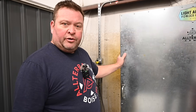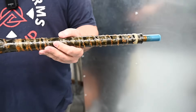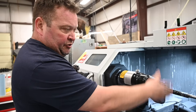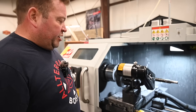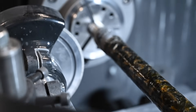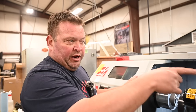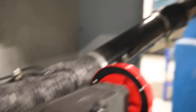Now we'll show you the finish grinding process. We have a barrel set up in the lathe with a custom grinding motor setup fitted with a diamond grinding wheel. We grind all the carbon and profile the steel to get that clean carbon fiber blended surface. Every part of this we've had to build ourselves — the riser plate, the grinding motor system, the machine programming. We even had to get a custom-built dust collector to capture the carbon fiber dust.